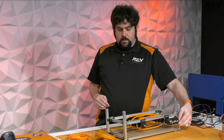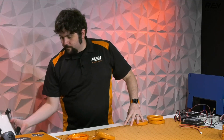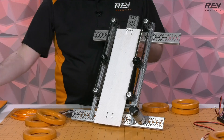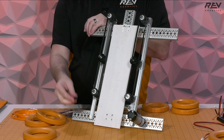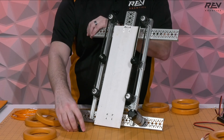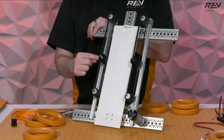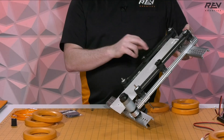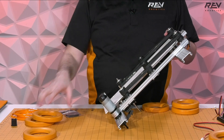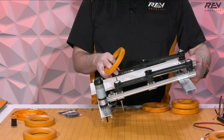That's a pretty good first prototype showing these are pretty easy to convey. The next prototype we worked on was more of an open style, and for this we used timing belt. We have a really cool timing belt pulley system that lets you build your own pulleys to whatever width you want — with centers and end caps. Because all of our belts are nine millimeters wide, or increments of nine millimeters, that plays really nice so you can build fatter center ones to run double belts on a single pulley.